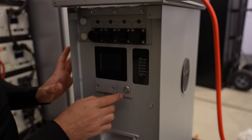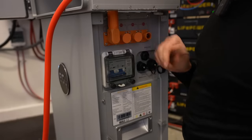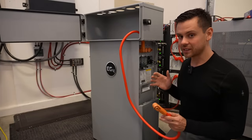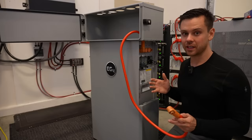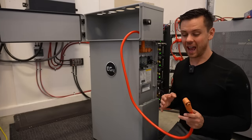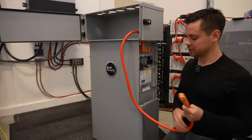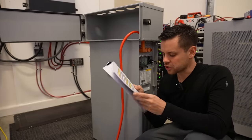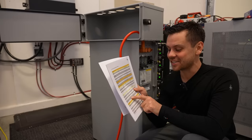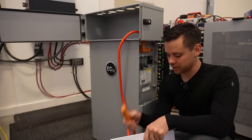When you're working on this battery you want to flip the switch off and then flip the breaker to the off position before you start working on it. Do not try to connect these cables when the battery is on — that's a major safety issue with this size of battery and the amount of current it can output, especially if you have three of them in parallel. The short circuit current is 600 amps, so with three batteries that's 1,800 amps. Ensure that all batteries are turned off before you start building your system.